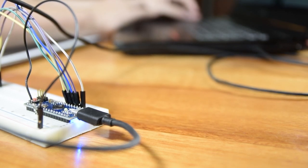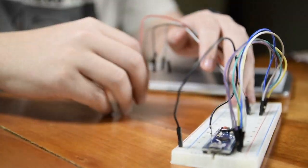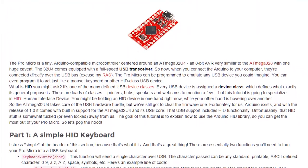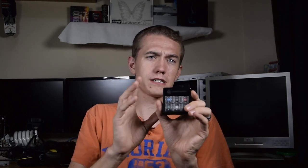Thanks to the fact that the Arduino Micro is a native USB human interface device and didn't need to be programmed as a virtual USB keyboard, and there was some helpful documentation on the SparkFun website, we were able to get the Arduino Micro to function as a keyboard. But then that left us with the problem of whether we could actually fit the Arduino board and necessary jumper wires into the Cooler Master CM Storm Mechanical Key Switch Tester.